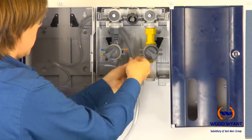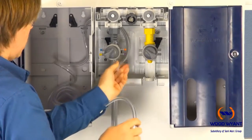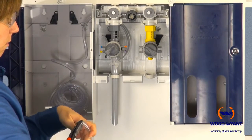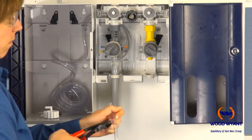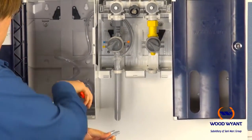Since the product will be fed to both a high-flow and low-flow eductor, the next step will be to install the provided Y-barb from the accessory kit. To maintain prime from the Y-valve to the eductors themselves, you'll need to install two check valves. Cut two tubes to desired lengths, place over the Y-barb, then install a check valve for each line.